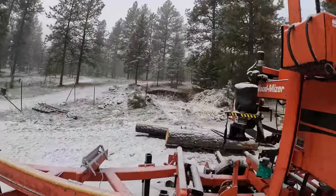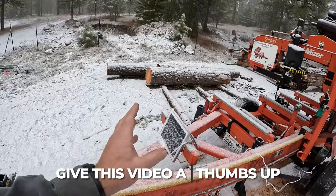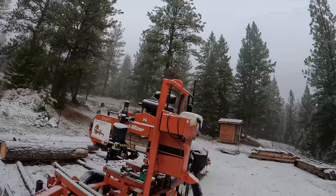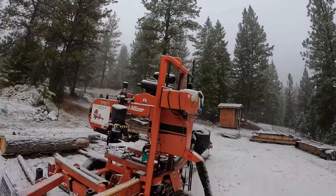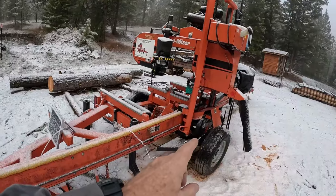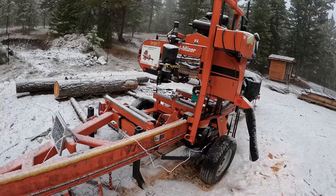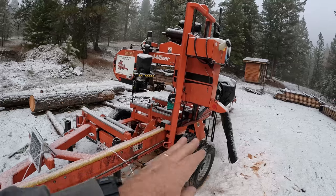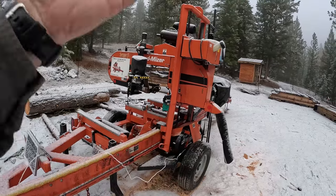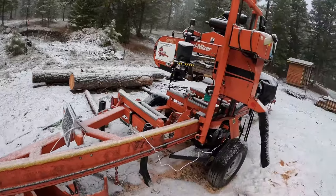The last thing I've done — I'll drop a link to this as well — is I bought this battery maintainer. Right now it's only temporary; my plan is to mount it on the umbrella stand so it can stay there permanently. The only thing is you're not supposed to have it connected when the mill is running, so you've got to disconnect it or put a switch in. I've had trouble with batteries dying, so I just put the battery cover over it like a tent and connect it up — the sun burns off the snow and provides a charge.